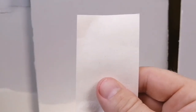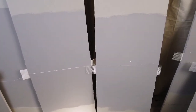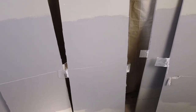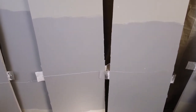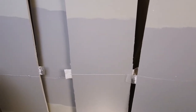It also means that in the test, some tapes will produce a surface crack, but they will never actually split apart, nor will they ever. The amount of force to make them split in two would far exceed any stress they would ever receive in real-world conditions, especially if it exceeds the strength of the drywall itself. The most important information to be gathered here is when the joint produced a crack, and not necessarily when the tape physically split into two pieces.